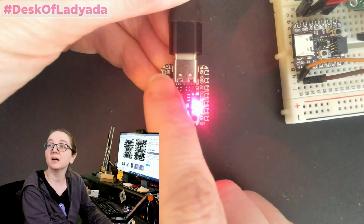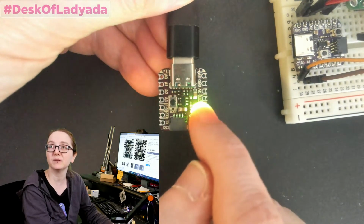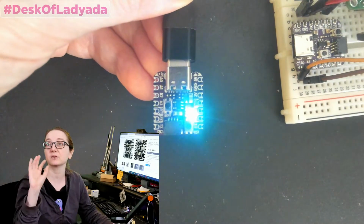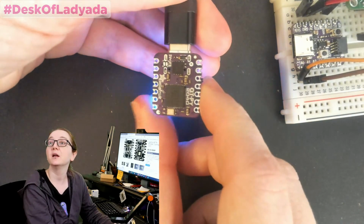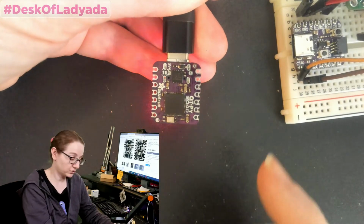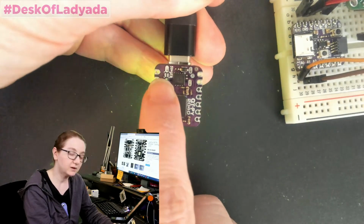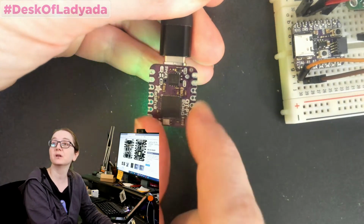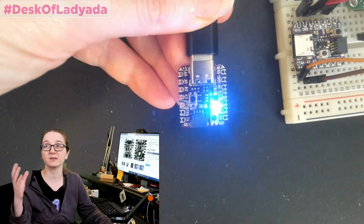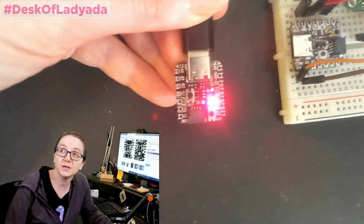You've got power and 4 analog pins, and then 9 GPIO pins total here. And then you have 2 more GPIO pins extra on the Stemma QT connector. You get 2 I2C ports. And on the bottom, there's the chip. We've got 8 megabyte flash QSPI and a crystal. And Bill B asked me to put a little jumper so you can short USB to 5 volts, and I did. That's not for most people. You want to have that diode protection. But if you want to back power USB because you want it to be a USB host, you can do that too.